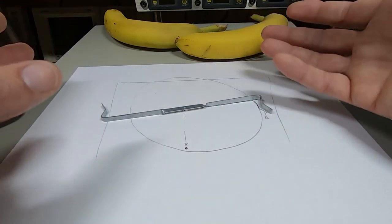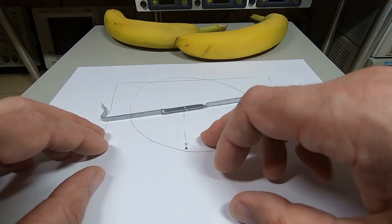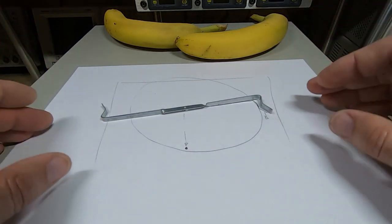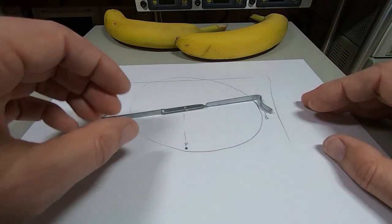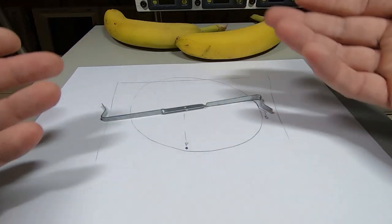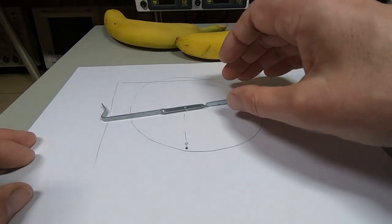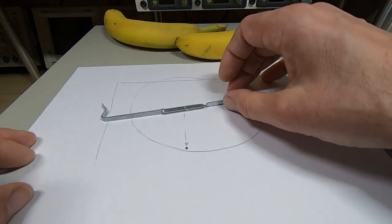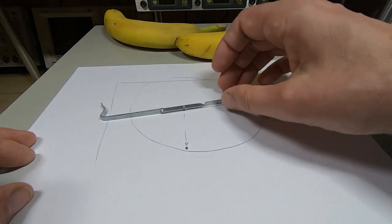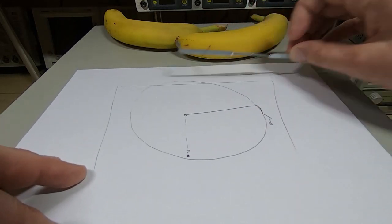It's mixing up the air, it's making sure that the sensors, both sensors, are subject to a mixture of air, so it's not just the radiant heat from the heaters, it's measuring air temperature, so it's controlling through air temperature, but it allows you to control the infrared profile. To get this to spin at the right speed was relatively straightforward.